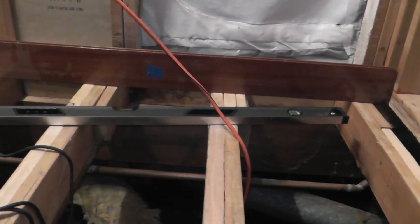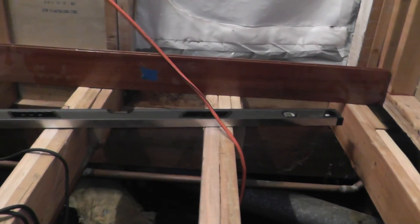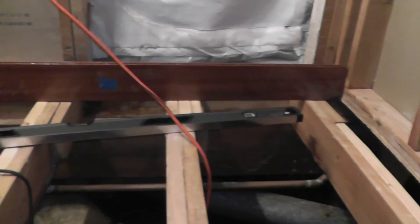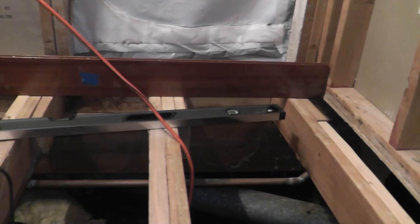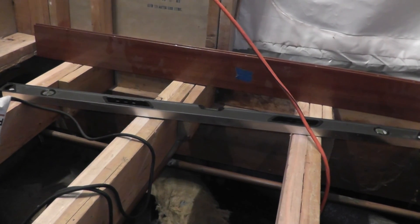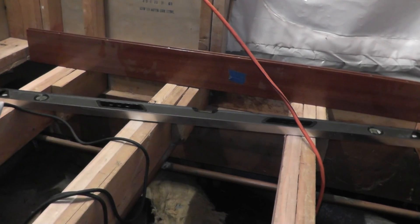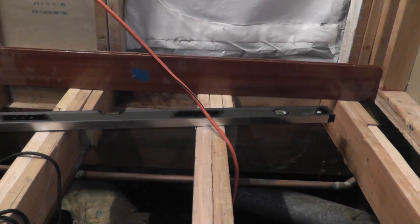I have a straight edge — this is a piece of wood flooring I had left over, and it's five feet long, which fits perfectly in this bathroom. I had to sand down the ends of the joist over there. I'm checking once every foot so I don't have the joists doing like this as I go along. I don't want to take off too much material when I'm sanding, and that's why I am checking once every foot.